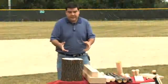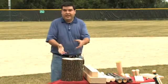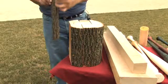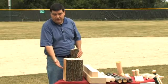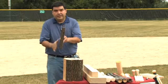What I have here is basically a log of hard maple, sugar maple. What I've done here is I've actually cut it up very similar to how it's cut up in the sawmill. They make a first cut and open up the face, and from there they can tell what quality of wood they have in this log. Their first cut is always trying to be very parallel to the outside bark.